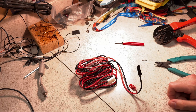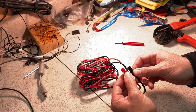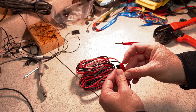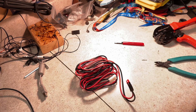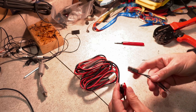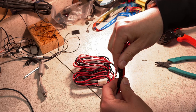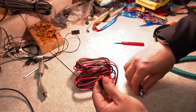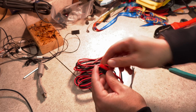Now comes the part that always gives me trouble — figuring out the arrangement of these connectors. Is it red on the left, black on the right, or the other way around? And then which orientation, because it has two orientations — shielded side, unshielded side — since the connector itself has an odd hook to make the mating happen. What I do is use other power poles that are already done as examples. If you have a better way of doing this, leave a comment below. The red slides on the black, snaps, goes together. I'm going to put one of these pins to keep things from shifting around so it can't be undone without taking that pin out.